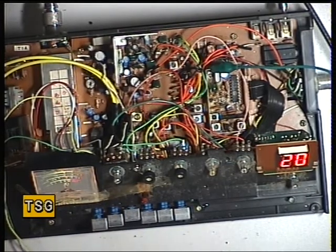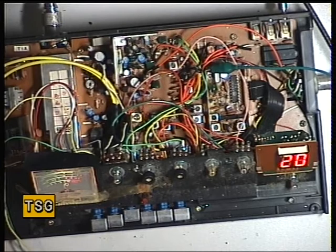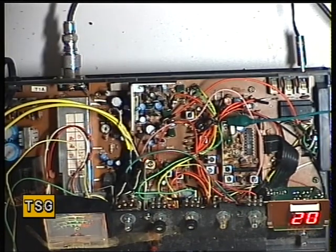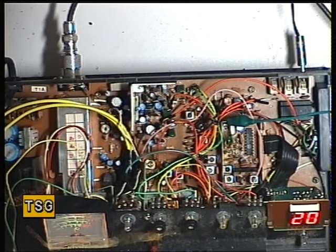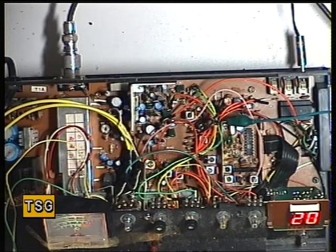We've got three watts. I have to admit that's often what you get out of this type of radio. It actually says the maximum power output is 3.7 watts. Now this test set is a proper commercial test set, and I find with CB equipment what it says is 4 watts is often equivalent to 7 good buddy watts. So people with cheaper power meters might think this is doing about 5 watts, but in reality it's actually doing 3. There's always a discrepancy because these are properly calibrated instruments.